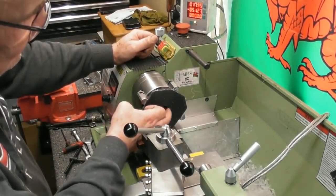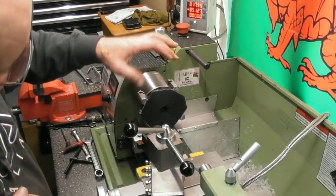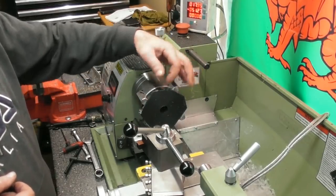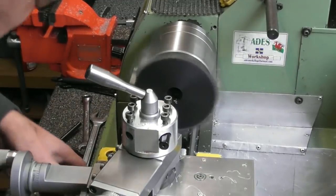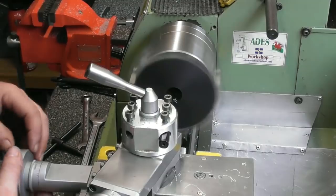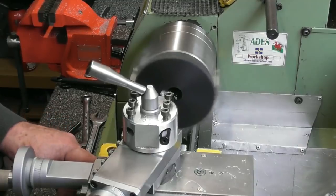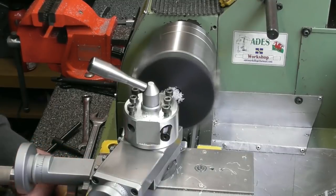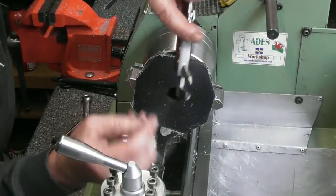I think it's a boring bar job next to do the register and bore that out. I'm going to have to be really gentle when I do it because I'm taking a bit of the strength out of the middle. Because I'm only gripping it on the outside, I think we'll be all right as long as I take it easy. I've got my 12mm boring bar up. I'll just touch off in there and take about 0.2 a side.